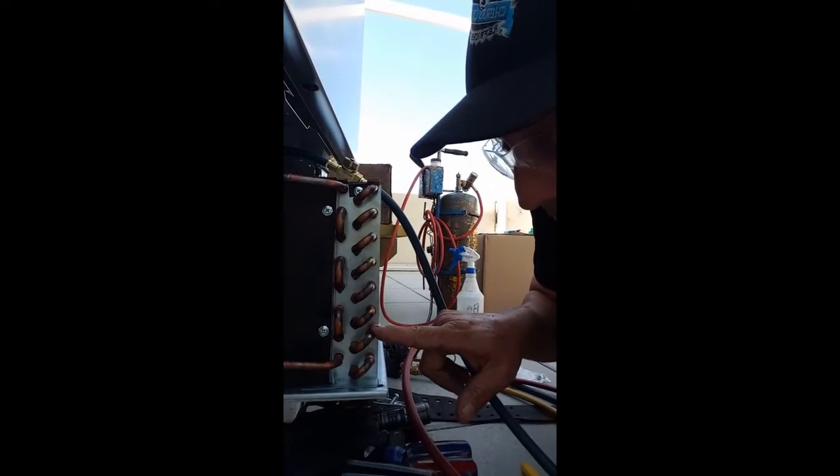You can see right there where it was leaking. I went through the rest of the system to make sure there were no other leaks. I checked the inside evaporator and the condensing units. I found leaks usually at the third elbow, in the dryers, and also on the factory pinch-off on top on the suction line. You should replace the compressor, and the filter dryer always gets replaced when you open the system.